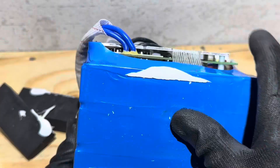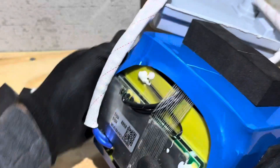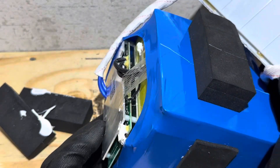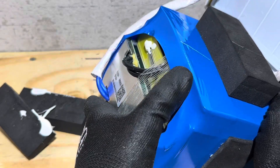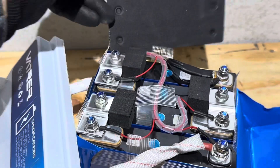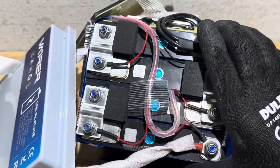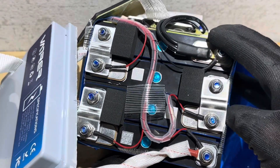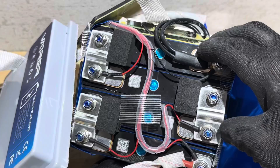Here's the cell pack out of its case. Prismatic cells in this one — the last one was cylindrical. We've got a temperature sensor glued down right here to the side of the cell pack. The BMS has its own high temp thermal switch as well. That's how it should have been built to start with. Whether this is a one-off custom sent to me or this is how they're going to be built going forward, I don't know. We've got bolted connections on these prismatic cells — expansion joints on the bus bars, everything bolted down tight, nothing loose. That's good to see.